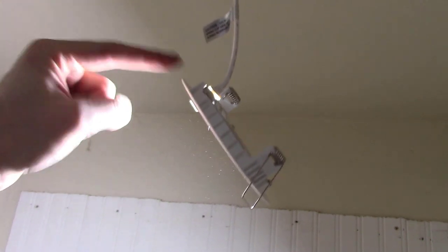So a little piece of drywall is up, just a 1/2-inch drywall. I'm going over the plaster with 1/2-inch drywall. So get that first light installed, and then I'll keep moving on. Maybe I'll finish the ceiling tonight, we'll see. To get it into the wall, you fold both these springs up on each side, get one started over the drywall, and then flip the other one up and just shove it in, and then both springs will flip back down and hold it in place. Whoop, almost fell. Okay, you can see the other one is installed.